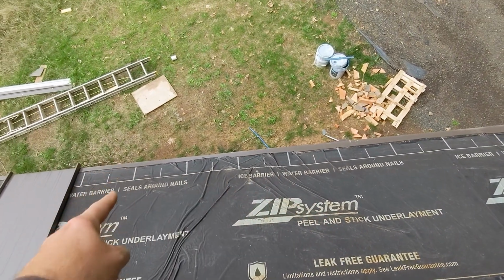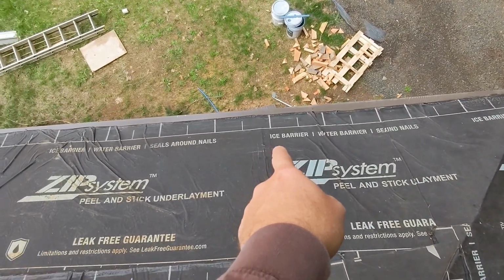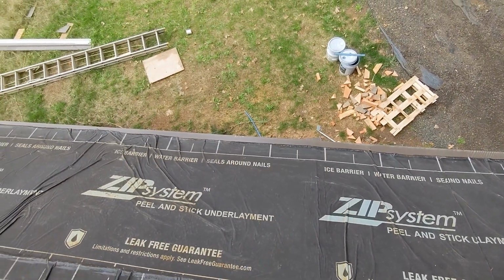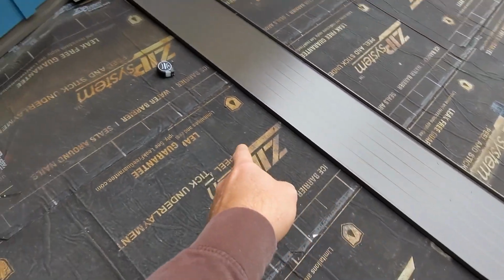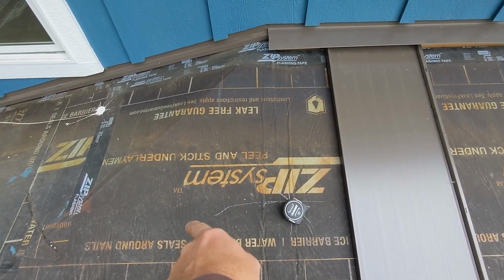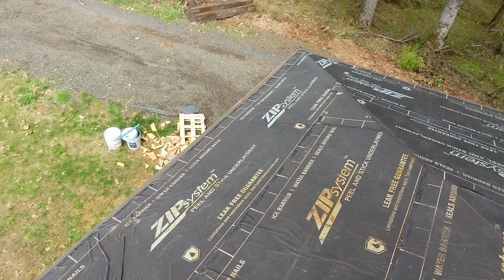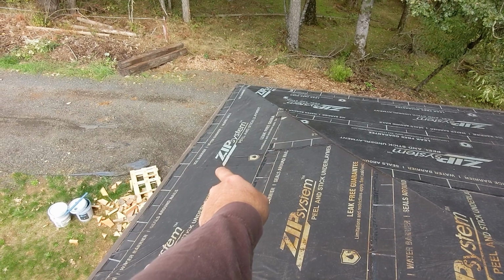And then I came over, that's a foot in. So I came over and again, a foot in right here. You can see that line there. And then 6 feet, 1 foot in. And then I took the tape measure off of this point and ran it up, and I drew myself, very rough, a little arc of what that 10 or that 8 foot was. So then to complete the 3, 4, 5, the tape measure goes down to the line that's down there,